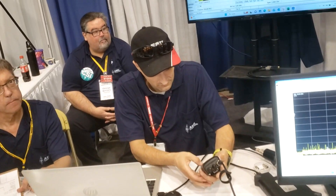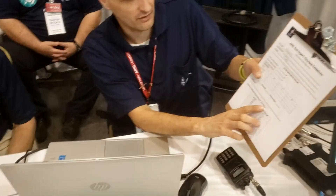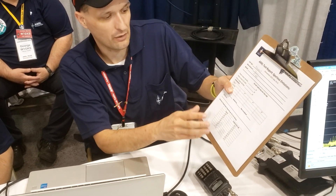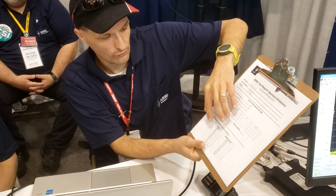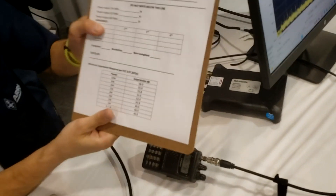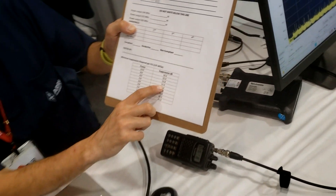So if you could tell me a little bit about what you're testing for? We're testing for spurious emissions, to see whether or not we are in FCC compliance. The FCC has the Part 97.307 rules, which outline what we need to achieve. For example, at a 5-watt power level, we need to be 53 decibels below the carrier to be in compliance with the FCC rules. And that's what we're testing today.